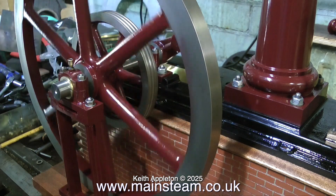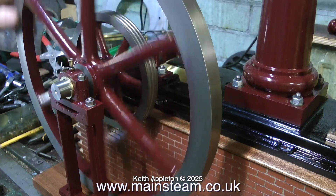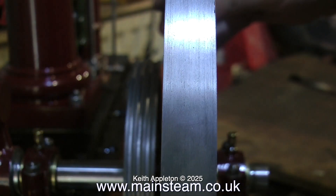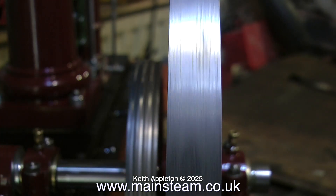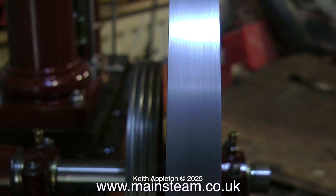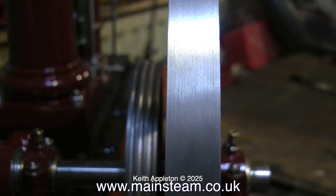After slackening off the top caps and giving them a bit of lubrication, I can spin the flywheel to see how concentrically it's running. I've gently pinched one of the grub screws. The whole crankshaft is oscillating from side to side — that will be put right when I put the packing pieces in. With this vast improvement in concentricity, it's time for me to go. Stay safe, stay healthy, thanks for watching, and I hope you found it useful.